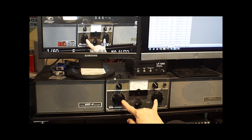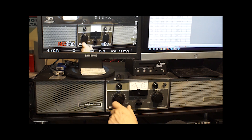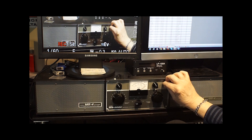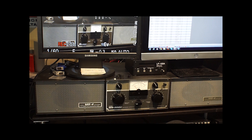So that's how fast it tunes. It's a matter of rocking these two knobs — the in and the out — until you start to get a low SWR, then continue to maneuver them until you get it as low as you want. Really, anything less than 2-to-1 is good. Let's go to 100 watts out. That was indicating high SWR because I hadn't calibrated it — let's do that real quick. Calibrated, and SWR is about 1.4-to-1. It's just that simple.